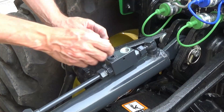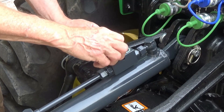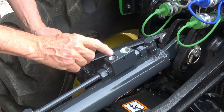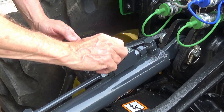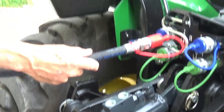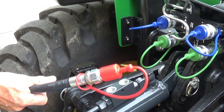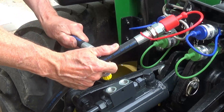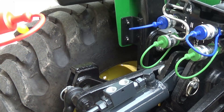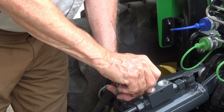With the new top link installed, I removed one plug already. There it is — there's a little rubber O-ring there, it looks like it's kind of painted on. Just give it a little pull and it'll come right off and you're ready to go. Everything was supplied that I need — all the hydraulic hoses and connections were all in this kit, so it was perfect being that I was a first-time installer. Since this was my first time installing it, I'm going to leave some mistakes in here so you can learn with me.